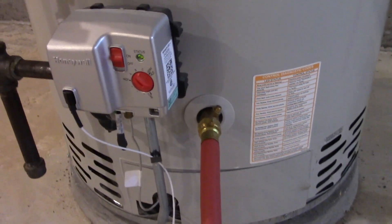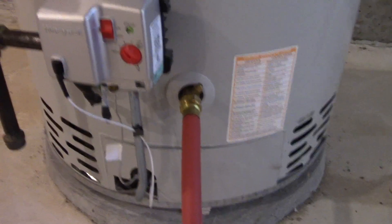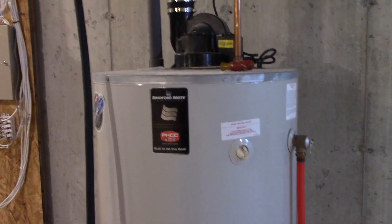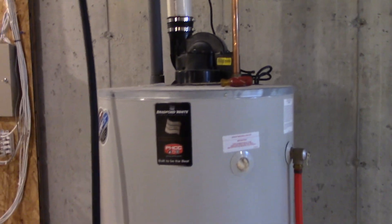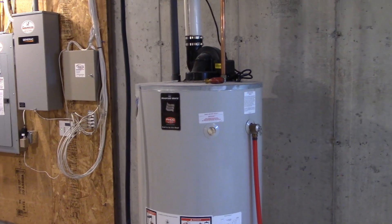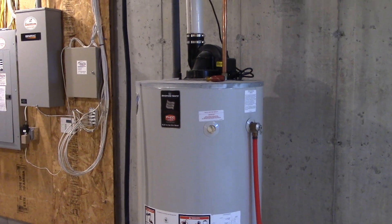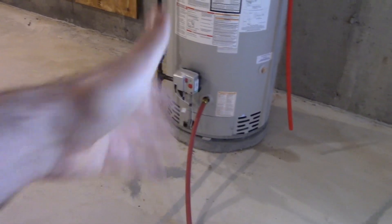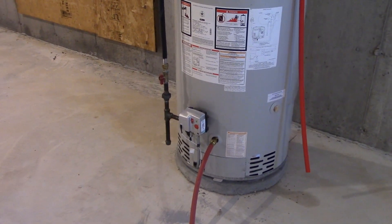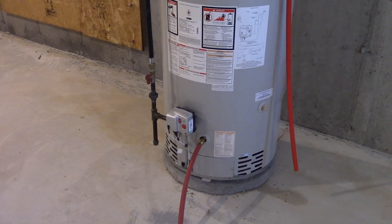And obviously this is going to take some time to heat back up. The larger your water heater is, the longer it's going to take, so be patient. But soon enough you'll be back to having hot water once again. And there you guys go — that is the procedure of flushing a water heater to help remove any sediment. It's good to do approximately every year, maybe two years, but maybe sooner if you have well water or very hard water, because you want to keep the water heater in the best shape that it possibly can be. It's all refilled, heating back up, no leaks — we did a good job. So hopefully this video was helpful to you, and if it was, fantastic. Thank you very much for watching, and take care.